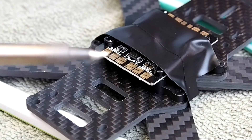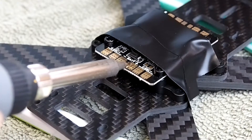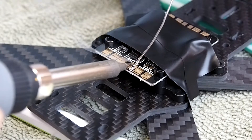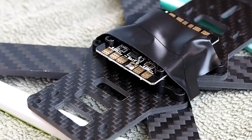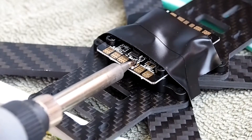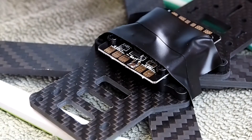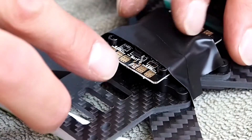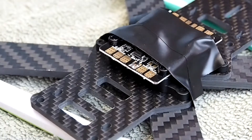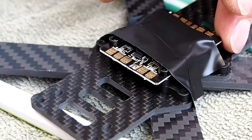I've got a bubble on there. Now at an angle, I'm going to come in and hit the positive pad — push down, touch — and start adding solder right in there, to the tip and onto the pad. That's plenty, probably more than enough. You can also move it around a little bit if you need to. Look at how close I got to that pad over there. Also notice how shiny, not dull — it's very shiny. Now I probably splattered a little flux onto that neighboring pad, so I'm not just going to go to the next one. I'm going to clean it off.